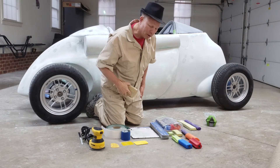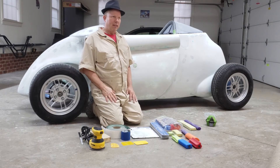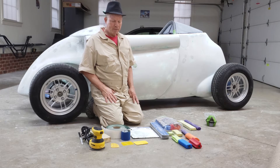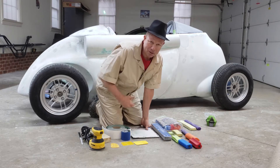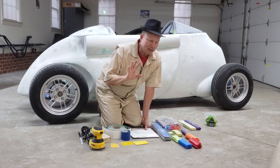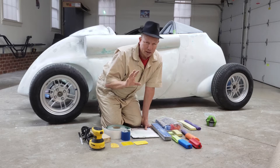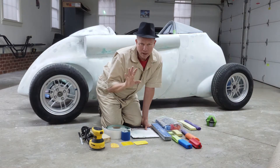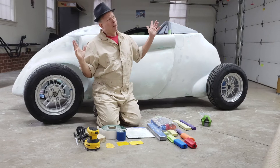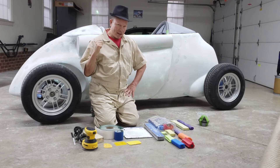After foam, you go into plaster — you just buy it by the bucket, by the gallon. I used about four gallons by the time I was done. Plaster only costs about $15 a gallon, so that's about $60 worth of material. If I hadn't done the plaster step and waited until the body filler step to do all that smoothing, body filler costs about four times more — about $65 per gallon. That would have cost about $260, saving you basically $200 just by going through the plaster phase first.